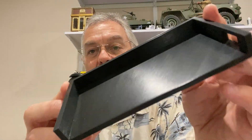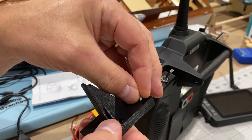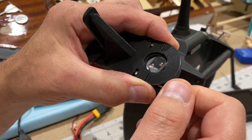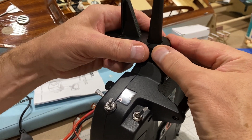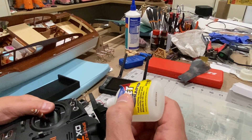I needed some way of fastening the monitor to that. This clamp is designed to have a screw fitting through a hole, but my monitor doesn't have that. So I've designed and 3D printed this bracket here, and I'm going to glue that on there. This piece is designed to take an M3 nut in there, and I'm going to screw those two together with a 20mm bolt. That's actually a very good design — nice and tight and firm. Right, let's glue that on there.